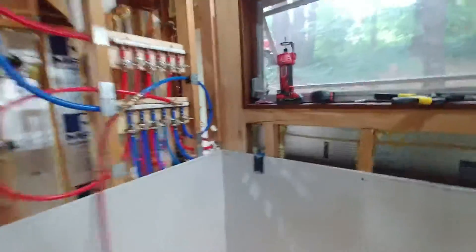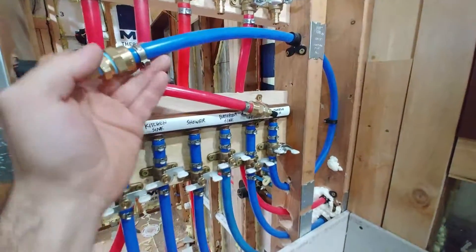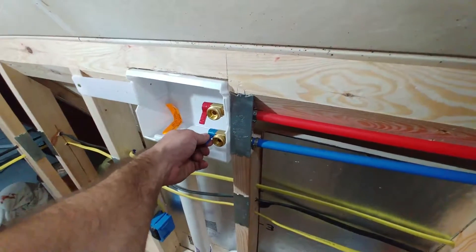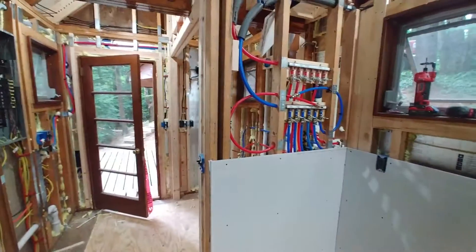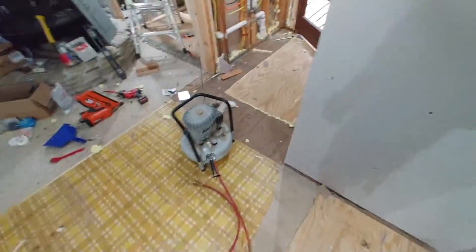We've got seasonal pressurizing and plumbing tests covered here because of the way this was set up. I like the little tire connection because you don't want to put 100 or 150 PSI in the system - it would never take that with water in it, and you can have catastrophic failure at that level. At 50 PSI it's a lot like a truck tire - people talk about slashing tires with a pocket knife because they don't explosively decompress. It's the videos of over-filling semi truck tires past 100 PSI where it explodes and hits the ceiling. So 50 PSI is relatively safe, especially wearing glasses.